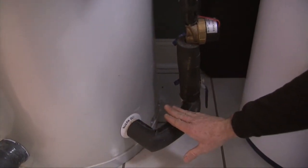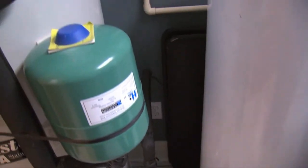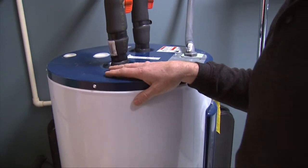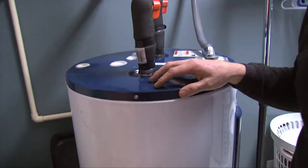That fluid heats up and goes through this boiler. You can feel the heat right here. This little pump circulates it through there, and it's got the heat exchanger in the bottom of this tank. It heats up this 80-gallon tank, which then charges this 40-gallon electric standby tank. So it almost eliminates the use of electricity to heat the water, especially on a sunny day.